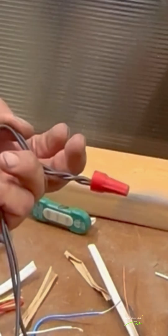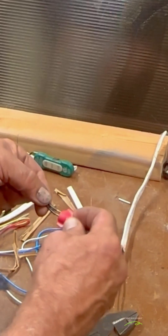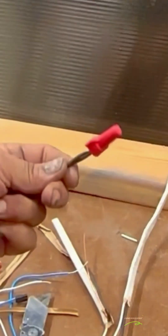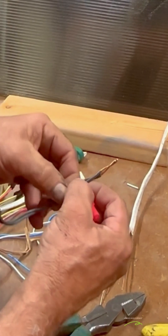Then use a red or yellow wire nut. The splice is so strong that removing the wire nut doesn't loosen the wires. Don't just put the wires together and rely on the wire nut to make a tight splice — I've had too many of these come apart just by pulling a switch or receptacle out of the box. Do it right, or you have no business doing electrical work.